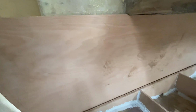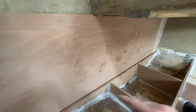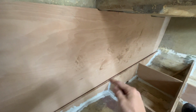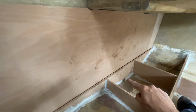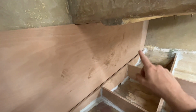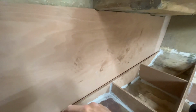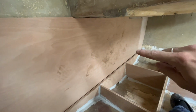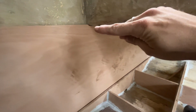Okay, and that's that wall in place, not bonded in yet. So what I'm going to do is draw a line across there, resin wash that bottom section there, this in a bit as well, cut the hole out, and then work out how I'm going to do it. I think the bottom would be easy: squeeze the bonding paste in, and when this goes down, squeeze it out. It's just going to be trying to get enough on the sides and at the top of here.